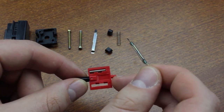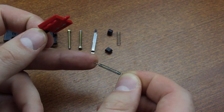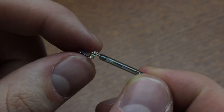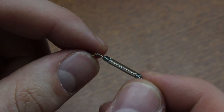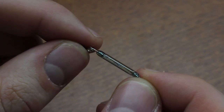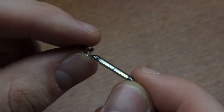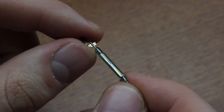This is what the switches look like on the inside. Essentially, there's a magnet in the slider here, which moves past the reed contact when the slider is pressed. The reed itself is a set of open contacts sealed in a glass bubble filled with inert gas. The proximity of the magnet causes magnetization of the contacts, which are then attracted to each other, closing the circuit and registering a key press. The advantage of encasing the contacts in an inert atmosphere is negligible oxidation when the circuit closes, as there is no oxygen present. Contact oxidation is what normally eventually causes a switch to stop registering reliably over time.